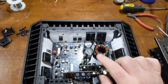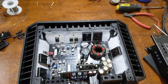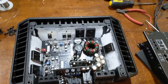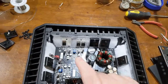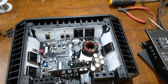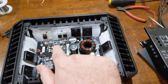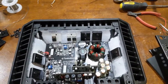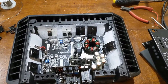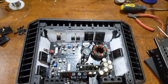The trouble I see with a lot of these is people will just replace that one part — like, oh, I'll just put another transistor in there with the right part number if I'm lucky. Sometimes people will just throw anything in there, put one in, throw it together, and say it's fine. No, it isn't. These — even though this is a class AB amplifier, or it might be class GH, I'm not sure — either way, it's linear. It's not class D, as you can tell by these four resistors and bias potentiometer. As a linear amplifier, most of the time you can get away with just changing that one. But these are MOSFETs — not NPN, PNP, or bipolar transistors.